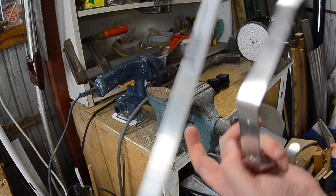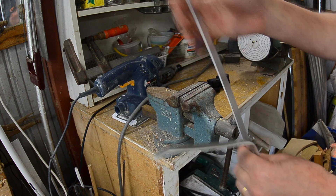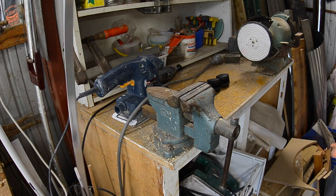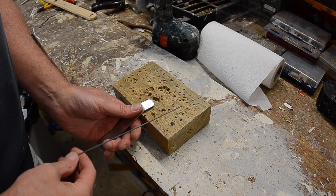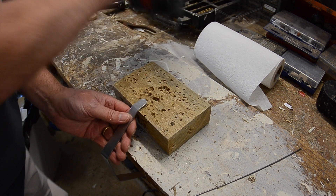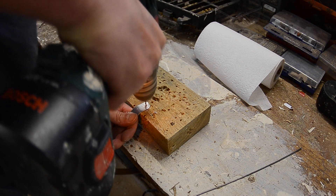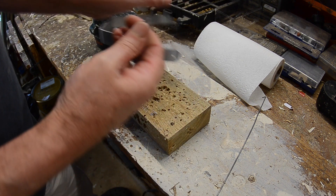For my own landing gear I used 20mm by 1.6mm aluminum from the hardware shop, but the Mini Ranger original landing gear is a little bit thicker and tougher than what I can make myself, so I'll stick with that one. I have to drill holes for the piano wire axle — that's about two and a half millimeters — so I get the appropriate drill and drill a hole. Then I use a countersinking bit just to get rid of those sharp burrs after drilling.